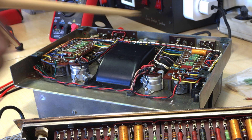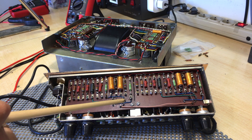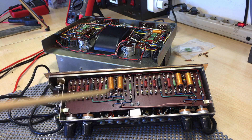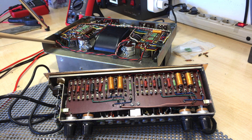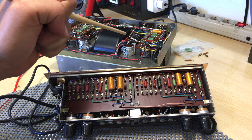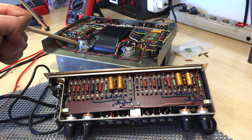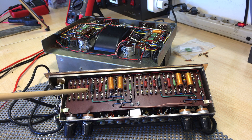One of these channels supplies power to the preamp, which might be a bit confusing. Usually each channel would supply power to the respective preamplifier stage, but in this case it's not done that way. The supply voltage goes in — each one is a separate supply to the power tube — and then it follows on and supplies the double triode, the 12AX7. Then one side goes on and supplies B-plus to both channels of the preamp.